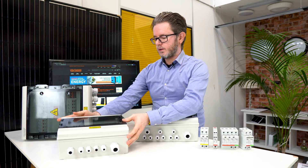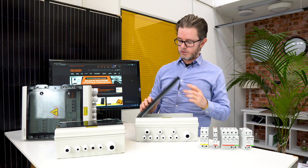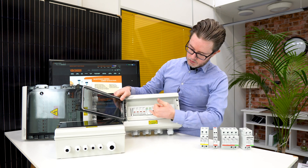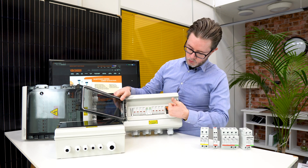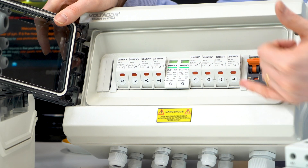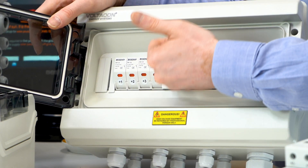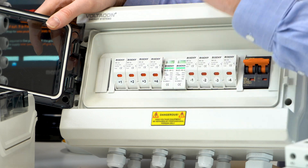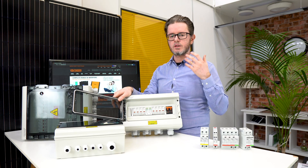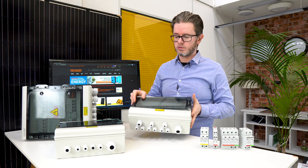That was the small combiner box with a single MPPT and only two PV strings. If you have more PV strings in parallel, you can get the four-way-in one-way-out, or the next available version is five-way-in one-way-out. The surge protection should be calculated correctly before you plug it in, so we need to know in advance whether you have a 100 volt, 500 volt, or even 1000 volt system.